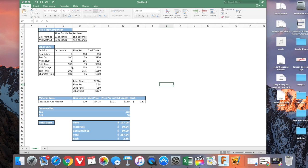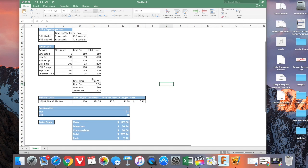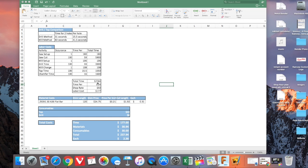Or you could say the same thing if you were to relocate over to the vise and use a hand drill. I did use the number for the hand tapping here: 15.5 seconds each to tap, and then the same thing on the chamfering, 16 seconds there. So if you come on down and look at 12,744 seconds total — if you convert that over into an hourly time, that's three and a half hours. At a shop rate of $50 an hour, it gets you to $177 to do a hundred of them.